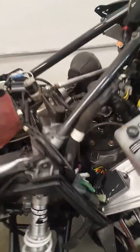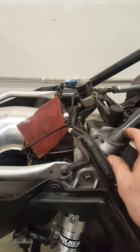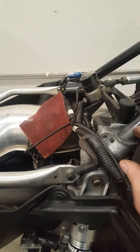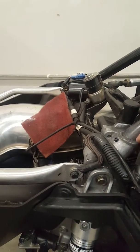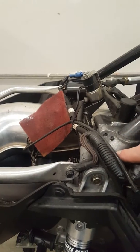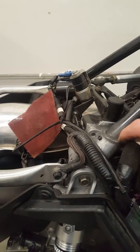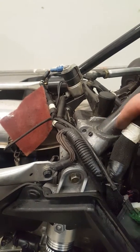So instead of spending a fortune on that whole piece, I simply got a piece of aluminum machined to fit inside this pipe here, just for the last two and a half inches or so. After that I epoxied it with just simple five-minute epoxy into this aluminum sleeve here. The epoxy I didn't expect to hold it together — that's simply to keep debris, water, and moisture from getting in there.